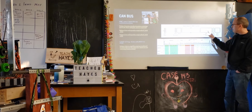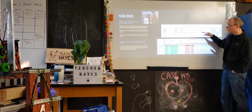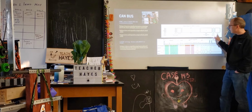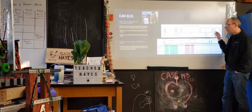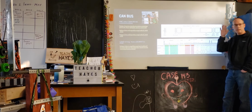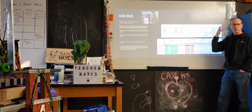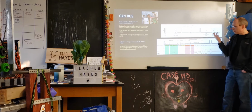And then there's a CRC, which basically is a way to cross-check all this in case you screwed something up, and acknowledge, and then the frame. So this is like a sequence of bits that everybody on the CAN bus is listening for. If you follow this sequence, you identify yourself, and whoever's listening for it knows what you sent.